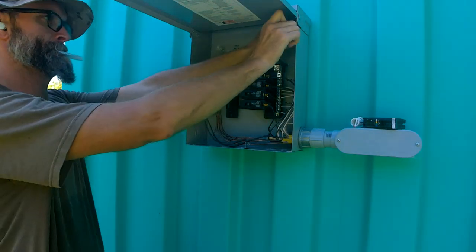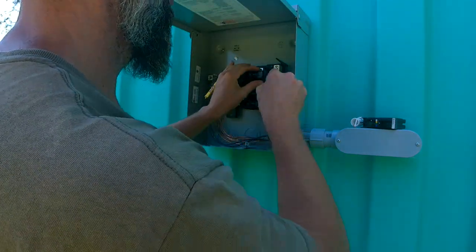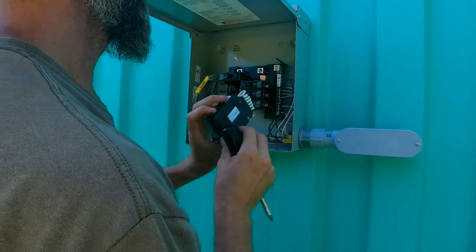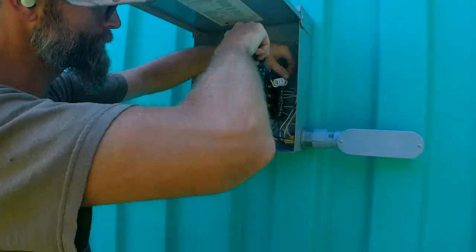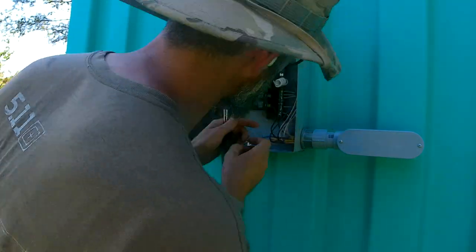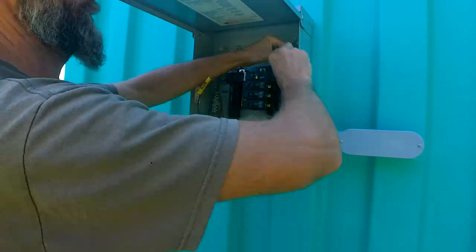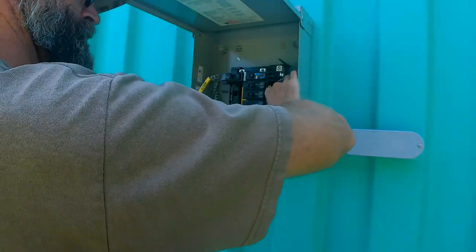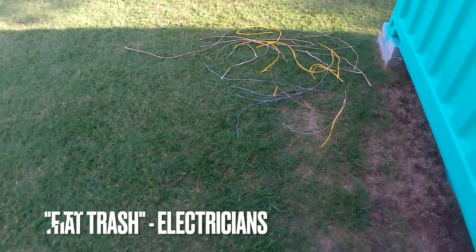I'm doing a combination of the breakers — arc fault and ground fault interrupters on the bathroom and kitchen stuff. It's really easy to do, just like the regular ones except you have the little white pigtail. You can see the breaker there — it's got another neutral wire that you hook in. You don't have to put two wires in one hole; you can just hook it up on its own. I'm not sure if you can put them in the same hole — again, not an electrician, rank amateur, do not listen to me on wiring things. But it's not hard, pretty easy to work in.